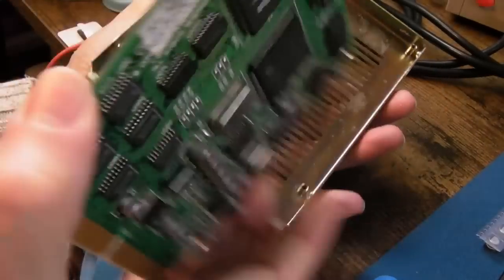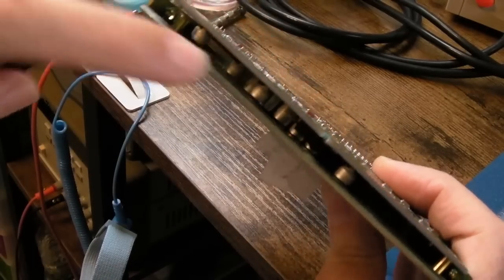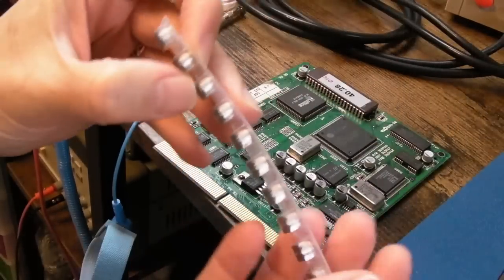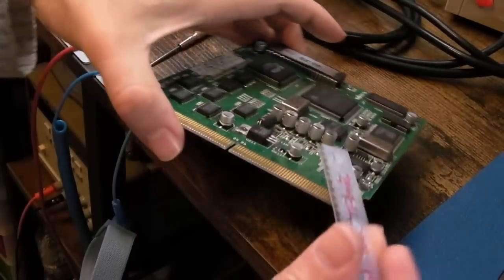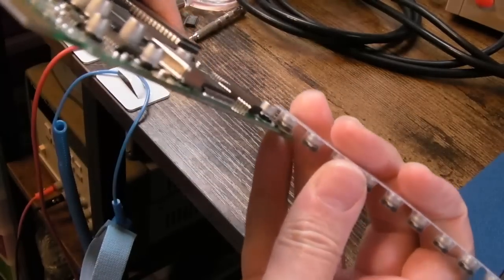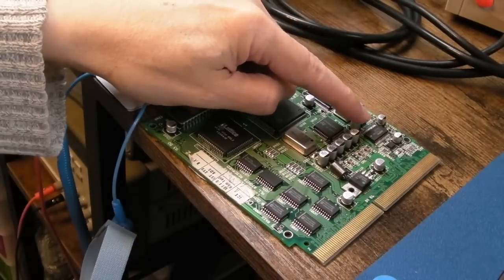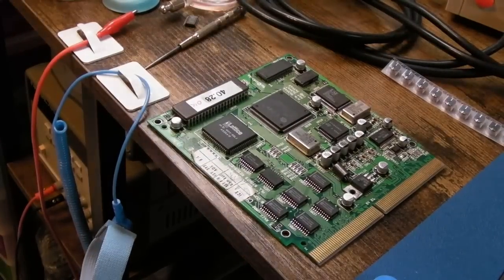Setting the board into the shell - if we put it that way up, the 100 microfarad caps touch the edge. They're not flat on these mounts, so those 100 microfarad caps are too big. Looking through my spare electrolytics, I've got about 20 of these 100 microfarad 16-volt caps, and if you look at the height they're about two-thirds the height of those ones - they're going to be fine. I'm going to use both irons and remove this strip of 100 microfarad caps.